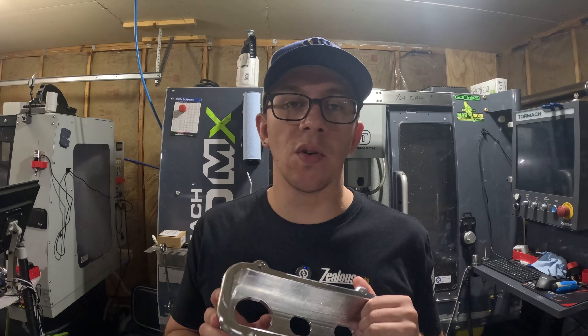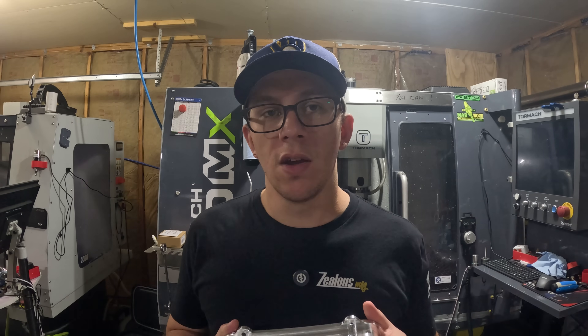So again folks, thanks for tuning in. That's the way I chose to sleeve these items and try to save them. So far everything works out well — we ran all of the pieces, everything seems good, and that disconnect is really nice and tight. I'd like to hear from you guys to see what would have been your approach — would you have chosen welding, remaking, or sleeving like I did? And if you would have done the sleeve method, I want to know how you would have tackled that. Some people would have probably just done op one, op two, finished the item, made sure the disconnect fits, and bolted it in. But I was concerned that once pressed in, the compression could cause that feature to collapse because it's a pretty thin wall. Curious how you guys would have approached that.